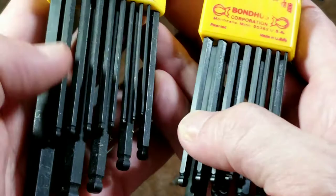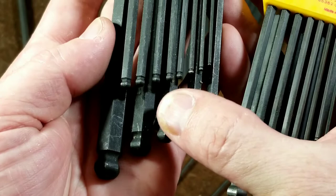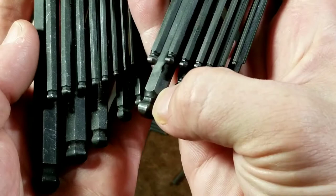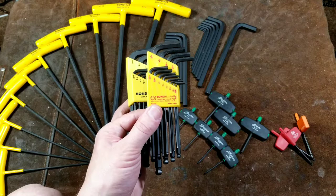Monticello, Minnesota is where they used to be made. The finish is not quite as nice as it used to be on the old ones, and they just don't do that little undercut anymore. Once the patent ran out, they decided they didn't want to spend the money on the additional machine time and tooling to make that little radius. The older ones really were a little bit nicer because of that, and that's how you can tell an old Bondhus — by that little radius.